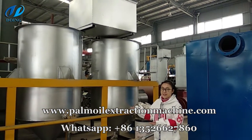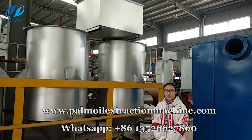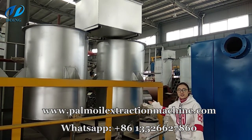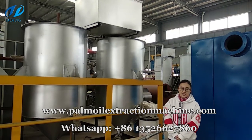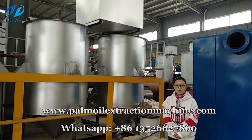These two oil tanks are named refined oil tanks. Firstly, we should add hot water to the oil tanks. Please notice there will be a little free acid in the hot water to remove the gum from the oil.